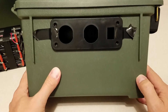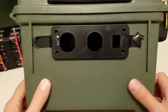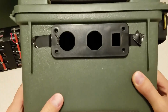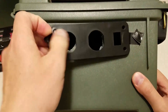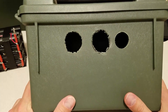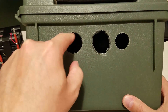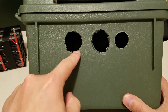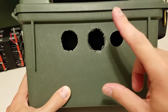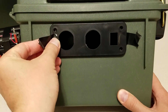To install my control panel on the box, I taped the control panel to the box itself and then took a Sharpie and marked the center of each port location. I peeled the panel off and used a hole saw — ideally a one-and-a-quarter inch hole saw, which I didn't have. So I used a spade bit that was an inch and then used a utility knife to cut the rest out. The spade bit hole looks really nice, it's perfect — except when you have to make it bigger. Now I can just mount this right up.